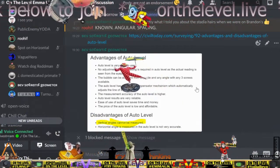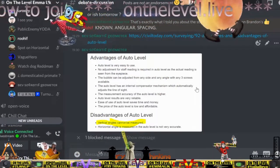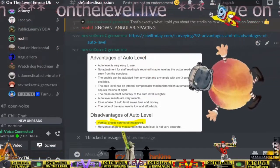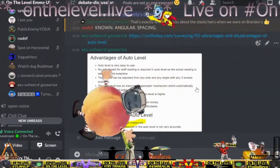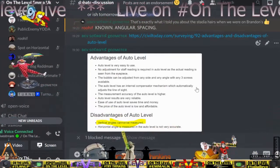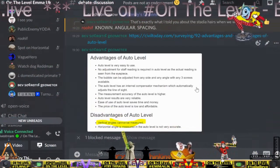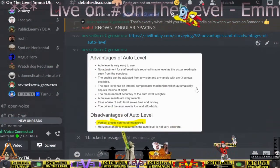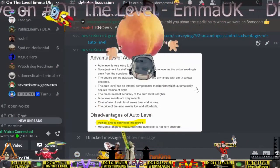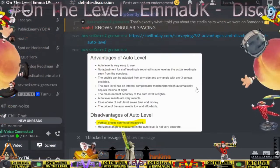They're actual sizes, right? You've only got one component of that 3-way relationship. How are you working out distance, which is the third component, without an angular size? You just look at the distance that it is within the stadia hairs. You look and see the numbers on the staff, right?